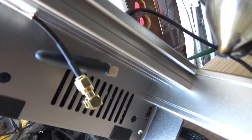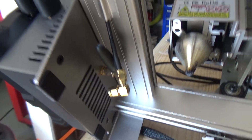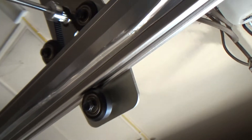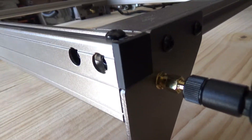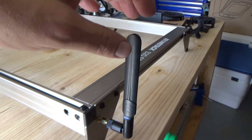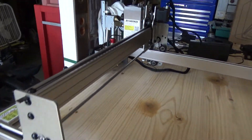The Wi-Fi antenna is right there. I bought a cable, and now I've got the S20 Pro — the silver Atomstack — and I just used some aluminum tape and taped the cable right along the edge here. Then I drilled a hole in that bracket, put the bulkhead connector through, tightened it up, and I've got the stud sticking out to where I can attach a common Wi-Fi antenna. This is an 8 dB antenna, and I'm going to show you the difference this one makes versus the old one, along with all the parts.